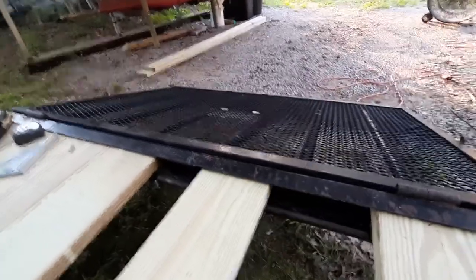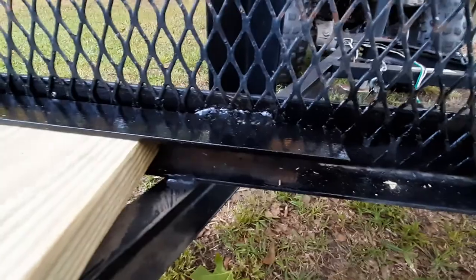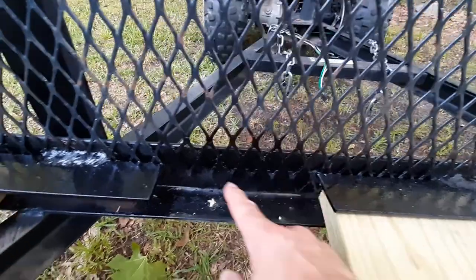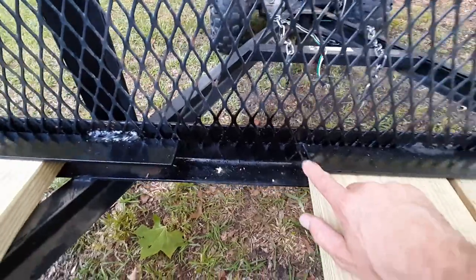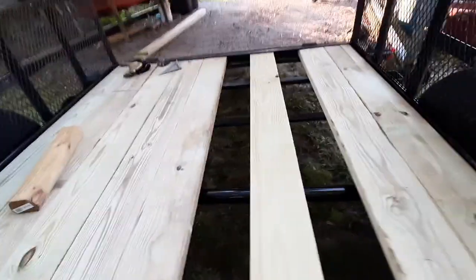What I did is up front — I thought it was angled, but actually the top part is just a piece of flat steel welded about every foot and a half or so. So I took my angle grinder with a disc and cut this out so I could take my boards and slide them in. For most of them I didn't have to do this, but when you get down to the last few you can't put them in at an angle.